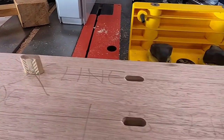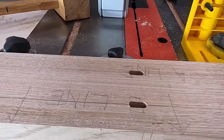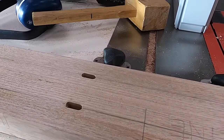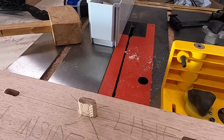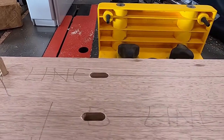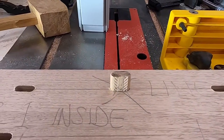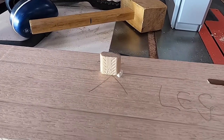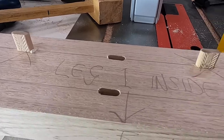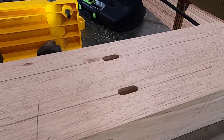The other issue I have is that I've drilled six domino pockets in each piece of timber. Now, that's going to make it way, way strong, like brick supermarket strong. In fact, brick supermarket that can withstand a nuclear attack strength. The issue that I have is that these domino pockets are not millimeter perfect, and the dominoes don't actually align all that greatly. That was, again, my inexperience of using this machine, and again, I can repair it. So, that's the situation. I'm going to have a caffeinated beverage and a sit down, and then I'm going to get this thing sorted out.